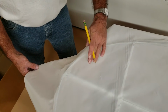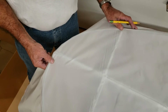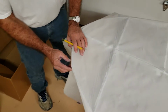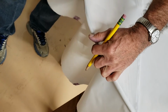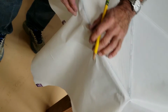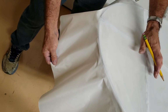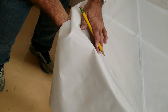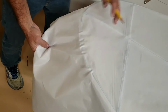You're still gluing it, and you're going to have a piece of reinforcement tape. The other way I've seen guys do this, and if I got someone else in the shop, sometimes it'll help. But if you already can see this, if he gets down here close, you can see this kind of pucker. You can see the way that's trying to do. And if you start trying to wrap this all around, which this is not as bad as, say, a wingtip bow, because it's a little bigger, but you also got guys, before I ever glued this little edge on, they might have left this whole end not glued. And with leaving this not glued, I'm going to unglue it here. They might have put it down just the way we did there, because them's all straight edges. But on this whole end out here, say from here to here, they didn't glue it at all.